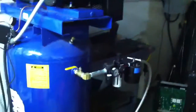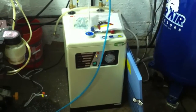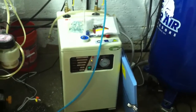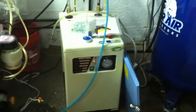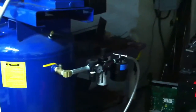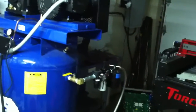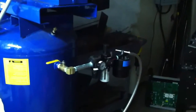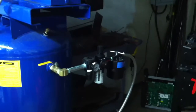A major update is the air compressor system. Long story short, I ended up having to send my air dryer back to Harbor Freight — it seemed to be defective — and I was surprised at how good they were on customer service. They sent me a new one. For now, I've actually run the motor guard filter right at the beginning of the system, because my concern was that this compressor is new and I think it was pushing some oil through even the 5-micron filter. That motor guard is an absolute fail-safe.